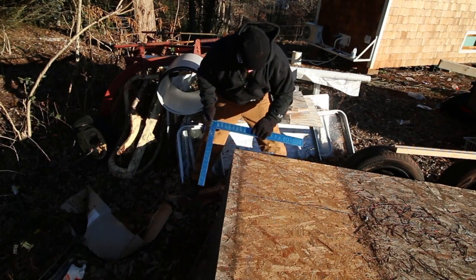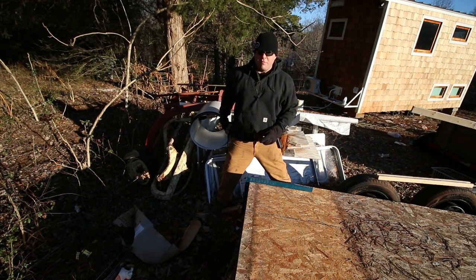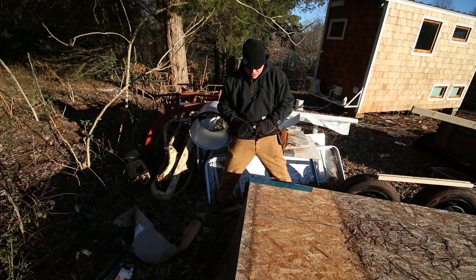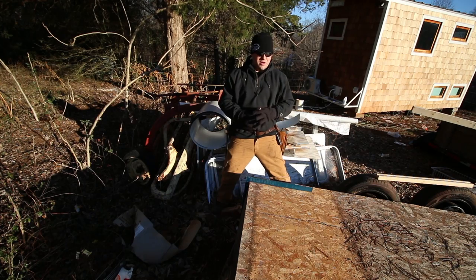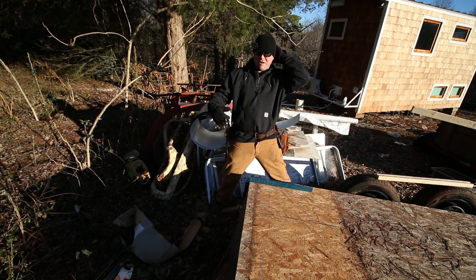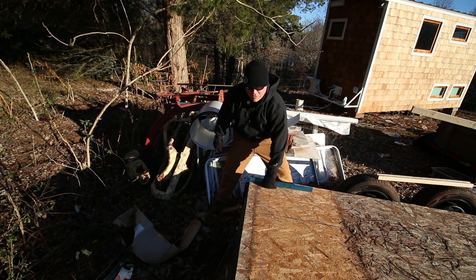The first thing I'm going to do is take a framing square and butt it down so this part right here is down on the steel, and then I've got this up top. I'm going to mark four inches. If you're going to do this, I recommend you mark three and a half inches and have your plywood hang down to the side of your trailer. But I'm doing things a little bit differently on this house — I am taking away an inch of interior space. I'm going to mark four inches here, which will be three and a half inches for my two-by-four and a half inch for the exterior plywood.